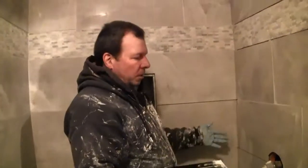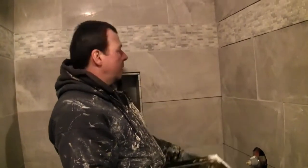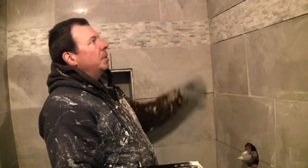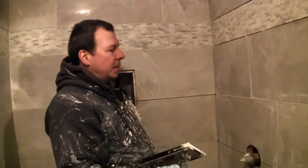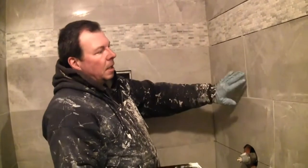Like I was saying before, this is going to set up in 25 minutes, so you don't want to go crazy and try to knock the whole job out in one shot. Maybe do a wall, and after that's done, you're going to want to go with your sponge and get all this haze and excess grout off of here.